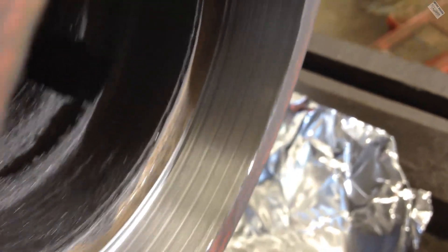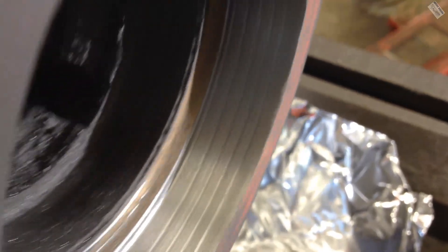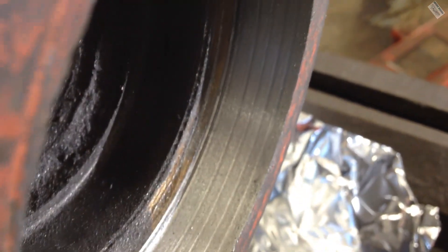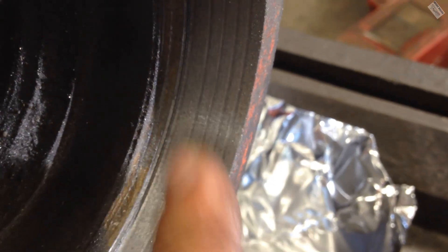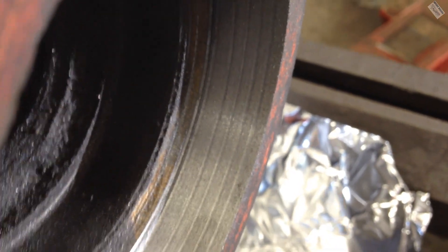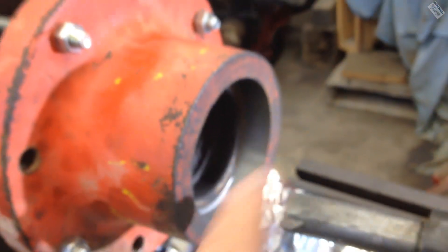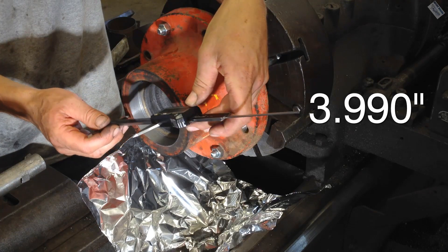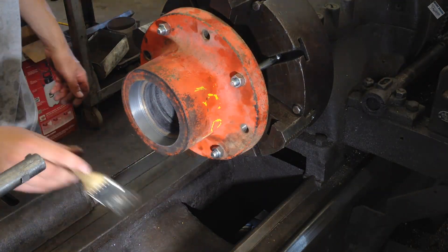I don't see anything anywhere — I've gone over a full turn now. I'll measure it and might take another pass, because I have no idea what size this actually is and I'd like it to be a number close to something I can build a bushing for. I took a spring cut — 3.990 on the nose. Next step.